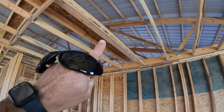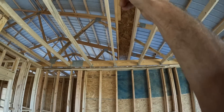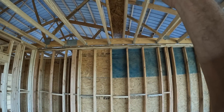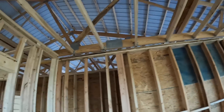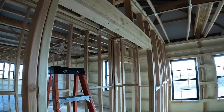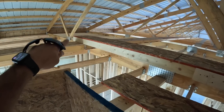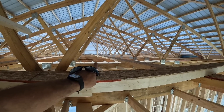We've got walkways up here. The way we make our walkways: a set of 2x4s are the original supports for the bottom cord of the truss. I go over 12 inches, do another set, then rip plywood at one-foot width and run it along there — that way you have a runway all the way to the other end. We do that on each side and in the middle, and then there's the attic access right here. When you come up through the attic access, there's a little step and then a walkway that connects all three, so you can get all the way to the other end.